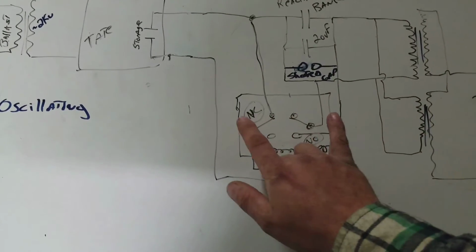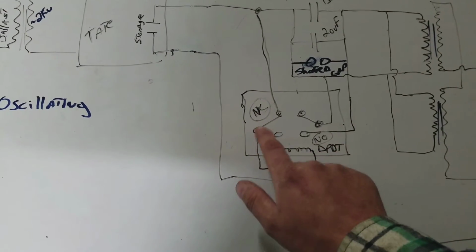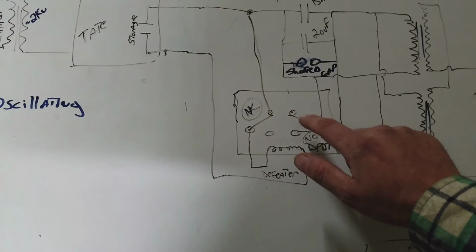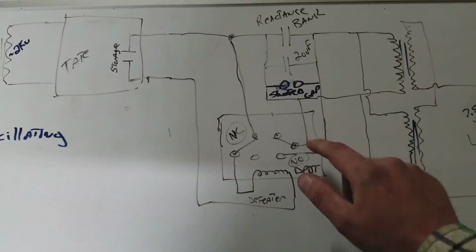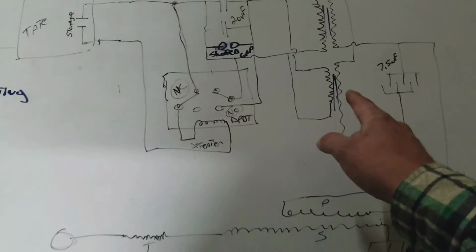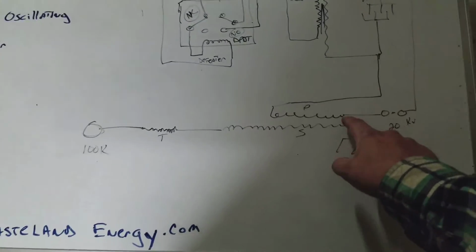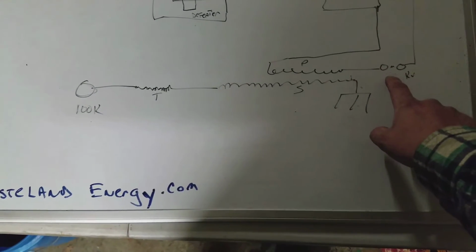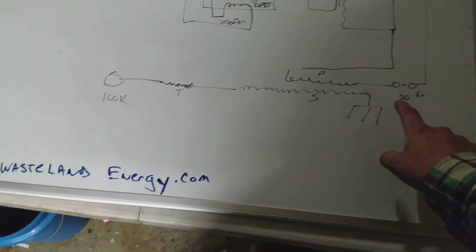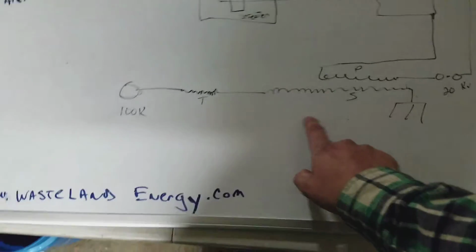So what you'll see is, you can see on both sides of the relay that we get a nice purple hot arc going on here, and then a real bright white crackling arc from these shorted condensers here happening on this side, and both of them fire the step-up coils, which are in parallel, and are able to activate the spark gap here, which is comparatively tiny, perhaps a quarter of an inch. I'll show you, and it's inducing into the secondary.